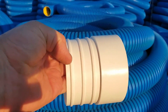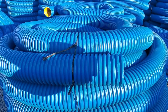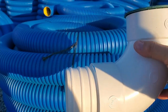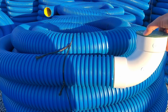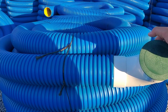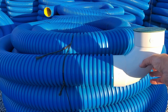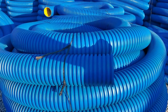See how it grabs the corrugated pipe and kind of hooks in. Here we have that coupler — the cone, as the guys call it — four-inch by four-inch smooth wall. It goes inside a pop-up emitter. What I like about this is it fits in the corrugated really nicely. Sometimes the lawnmower messes things up, or debris builds up, so if you have a ton of shingle gravel and didn't use a d-box, you'll want this part because it actually comes off so you can easily clean it out.